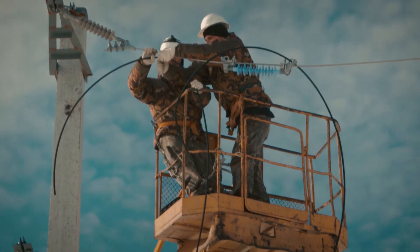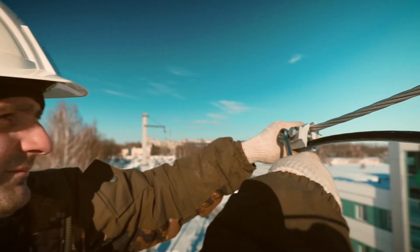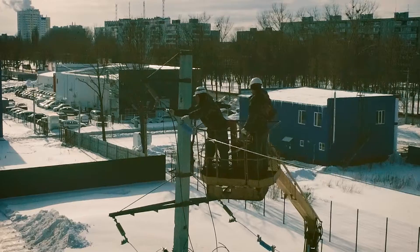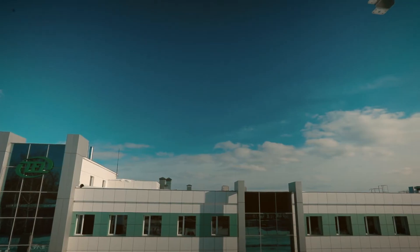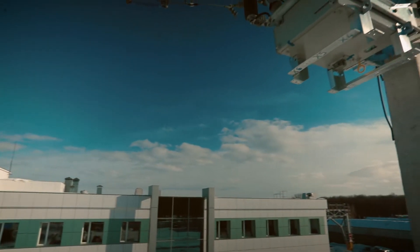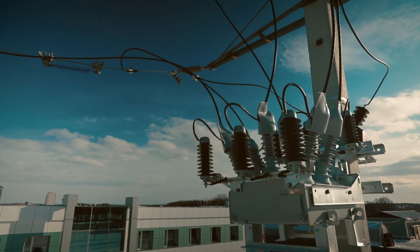Primary wiring connection depends on the type of the terminals supplied with a recloser. The RC series recloser has several terminal options, such as aerial clamps, lugs and NEMA connectors. The prepared HV wires can be simply connected to the line with clamps or to disconnector terminals.